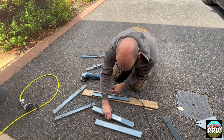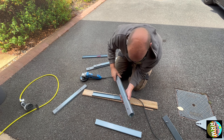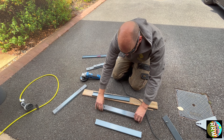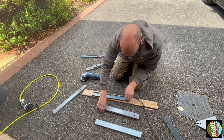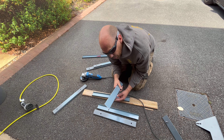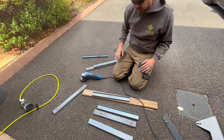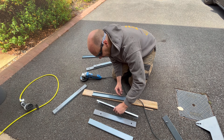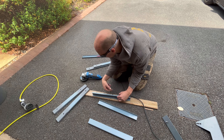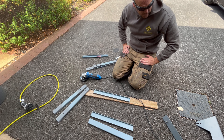Right, okay. What I'm doing here - I've got some box section which I'm going to weld together and make basically a box, and that's going to be welded in the car. There's two captive nuts and that'll sit nice and square and just lift the seat off the ground by an inch and a half. I'm just cleaning back the area so it's good for weld. And I will say - if any of my neighbors are watching this, I apologize for the noise, because since I've been building my car all they hear is grinding because I'm learning to weld. We're going to clean these back and then we're going to try and weld down the side and see how it looks. Big black sky coming over me so let's crack on, put it on time lapse and get these all cleaned up ready for weld.